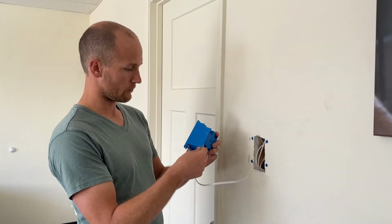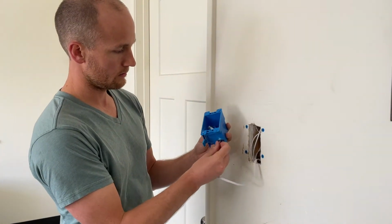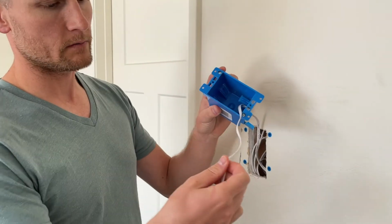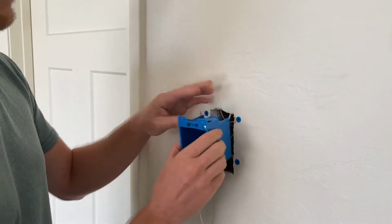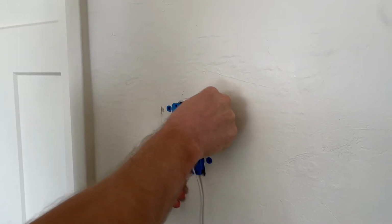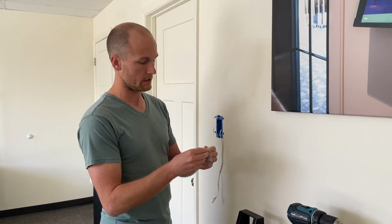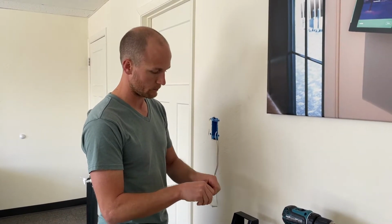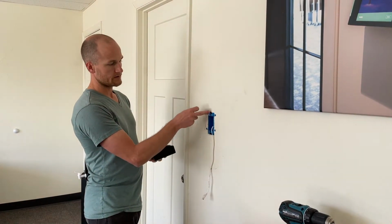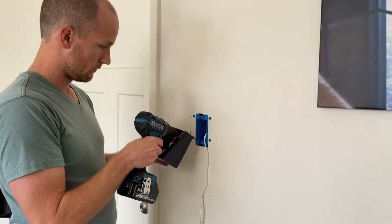Got this punched through already, so we'll run our Cat 6. If you use one of our cable lay, we use these super thin cables, which are way easy to run. Gang box is now set. Screws are included. I'll put the size screw in the description. They're on the instruction sheets that come with it. And it'll just center up. This is a single gang box, so it's just gonna center up right with the gang box.